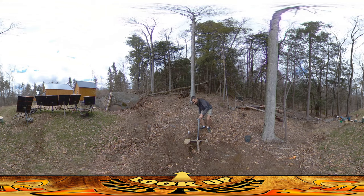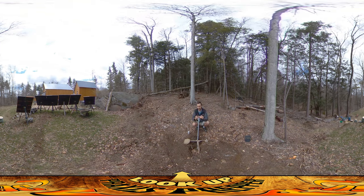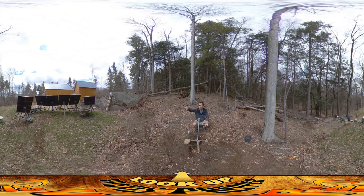Now I'm cleared to clip here, and I should be all good. Still kills me to clip wire. Alright, this tool strips down to 10-gauge, so I'm going to do that. What's going to happen with these wires is I'm going to be doing the union — running them in series — and that's going to happen with these panels inside this box, because you can daisy-chain all these panels together.